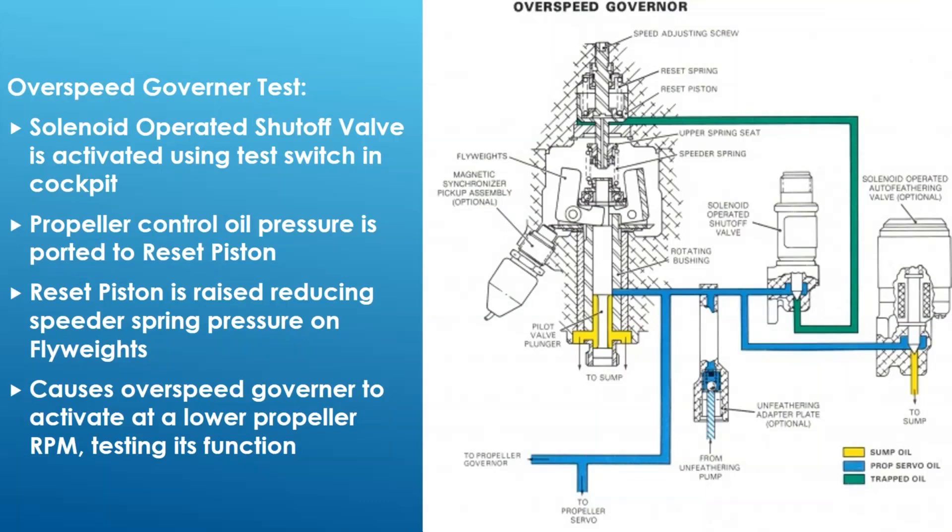We should see a drop - usually anywhere from about three to ten percent of the range. For example, if the King Air max prop speed is around 2700 RPM and it's supposed to drop ten percent, it should drop about 270 RPM - around 2430 RPM - and usually there's a plus or minus 50 RPM tolerance. When you close the valve and release the test switch, the pressure in the reset area drops, and then the prop will drop and come back up again.